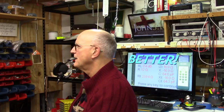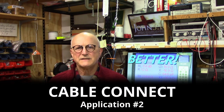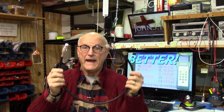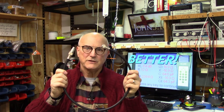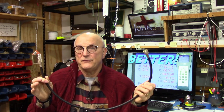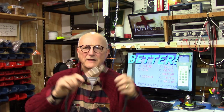I'll show you how to improve this a little bit later, but first I'm going to address the other application. The off-the-shelf calibration of the Rig Expert or any antenna analyzer is at the connector on the instrument itself. Transmission line realities tell us that putting any cable or adapter between the calibrated measurement device and the item to be measured will change the apparent measured value. The component may be highly capacitive but may appear to be inductive at the end of even a seemingly short length of cable.